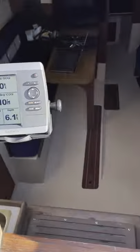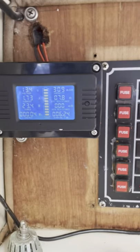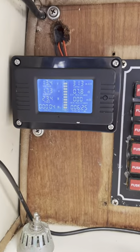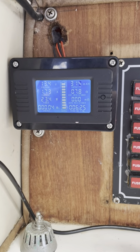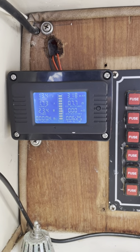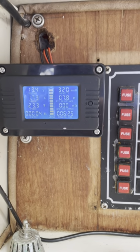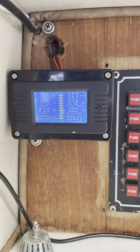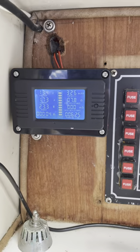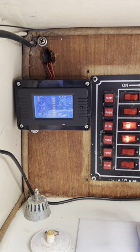This allows me to have the batteries closer to the panels — I don't lose the voltage drop I had before. I upgraded all the wiring. Going inside, we now have our battery monitor installed right next to our panels. It shows we're currently using 1.73 amps, shows our voltage. It is charging via the small battery charger — that's why we're a little high. It shows runtime and milliamp hours. This is a great little monitor from Amazon; it's a $20 monitor and it comes with the shunt so you can measure current.